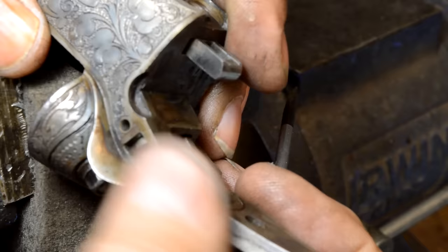I gave it one tap and out she came. The firing pin is sitting at this angle — coming down like this — and when you slide this out the hammer can hit this and rotate it down, and that's how it works. That little screw that was locking this piece in went down inside this hole right here — that's the locking hole. So I think that's how all that works, and I don't think this is broken. I just think it is dirty — we'll clean it and we might have got away with one.